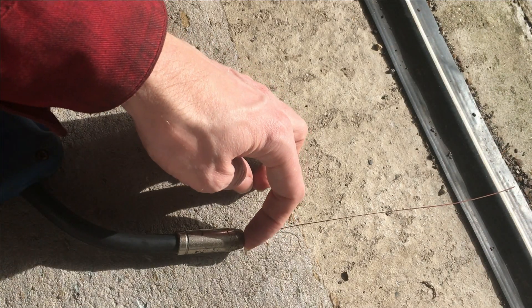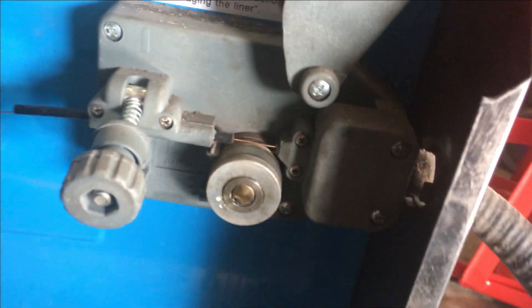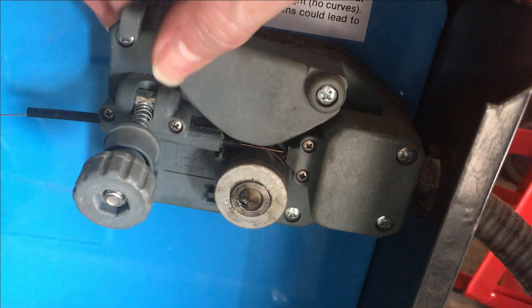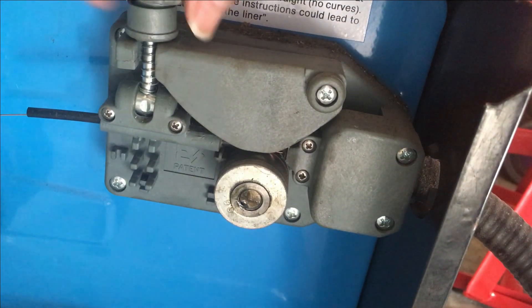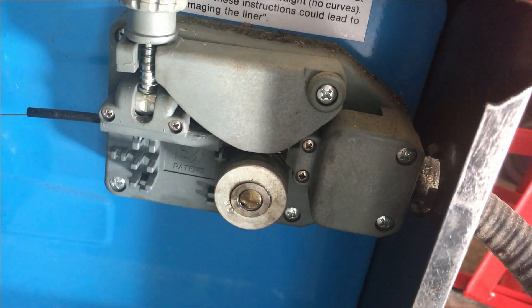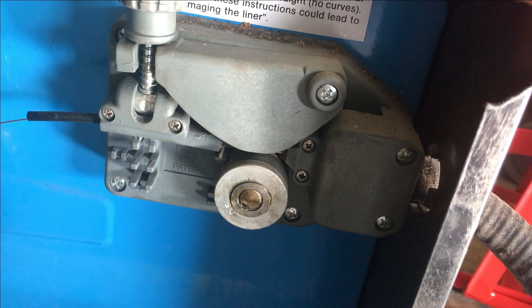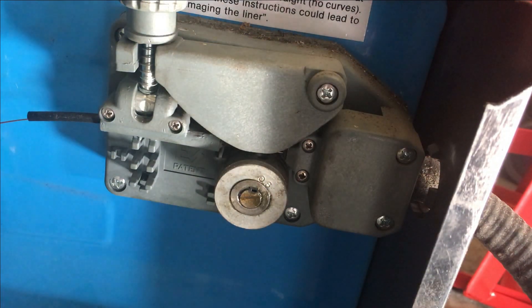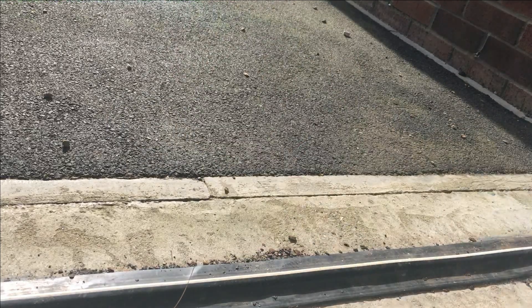When I'm pulling the trigger, I can hear the gas coming out the end and nowhere else, so I think that's resolved. This is all stuff that you should probably learn before you start welding — that's where I've made a golden mistake. Let's put the wire guide back on, make sure it's in the groove. Put that back on, screw that back on so it's all ready. I should now be able to quickly test and make sure that the wire feeds correctly. I can go to the end here — it's a bit bright, I'm afraid. Cut the excess wire off, ready to go again.